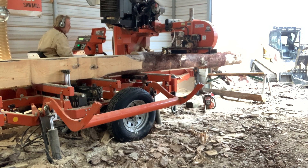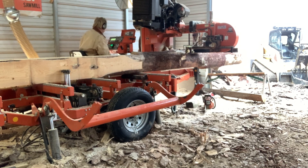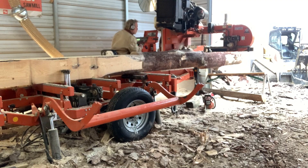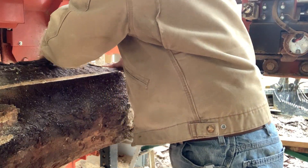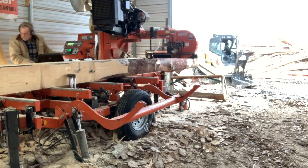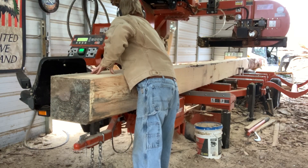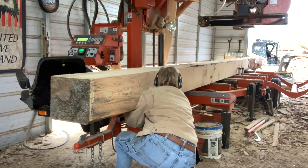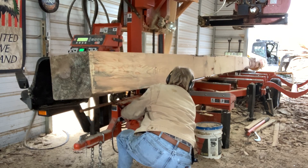But it's something that I had to have for this cabin build. I was going to piece some logs one time but I just decided against it — I thought I've got the long logs already down, so I just bucked them where I needed to. You can see there'll be a good bit of wane left on some of these, but when I come back and cut the finished boards out of it, it'll take away most of it. But these dimensions worked out good.